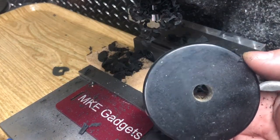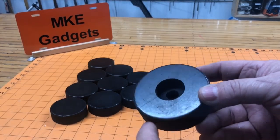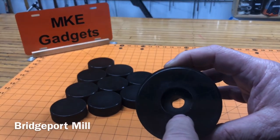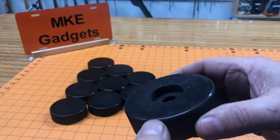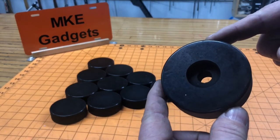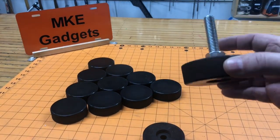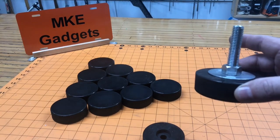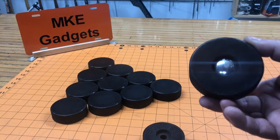The mill result is a little off center — I think because it got squished in the vise. The drill press one I went a little deep and had to do a layout line, and I'm surprised how off center that one is — again likely because of squishing during layout. Here's the one from the lathe: no layout line, easy to do, easy to hold. With the three-jaw chuck it squishes evenly and keeps it better aligned with the Forstner bit. I'll machine the rest of the pucks on the lathe — no layout line needed, easier to control the depth of the counterbore, and easier to get it on centerline.